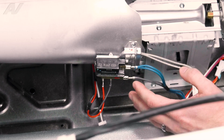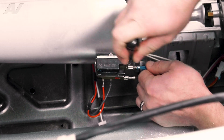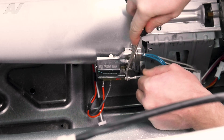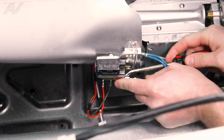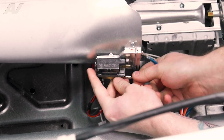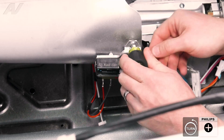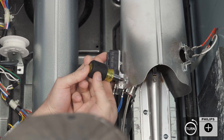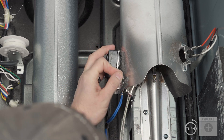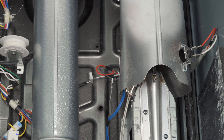Now, in order to remove your flame sensor, first gently start to remove your wiring. I tend to use something to give it a tug so I don't damage it. You have one screw on the top of the flame sensor that will need to be removed. Break it loose and hold on to the sensor while removing the screw. Pull out, drop the sensor down, pull forward, and set it to the side.